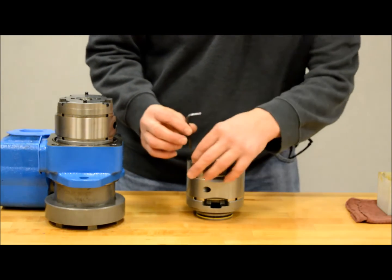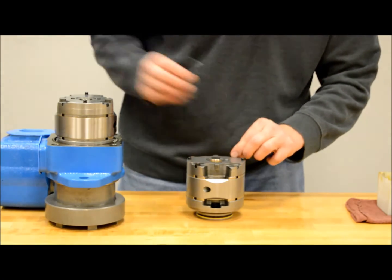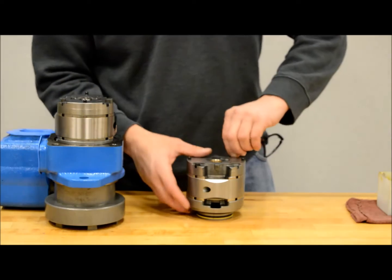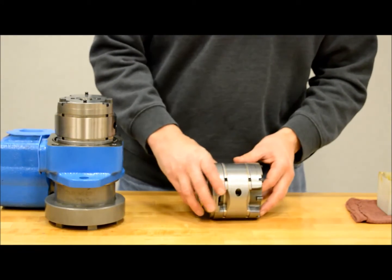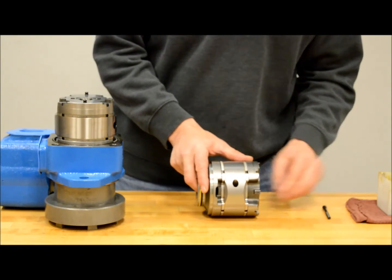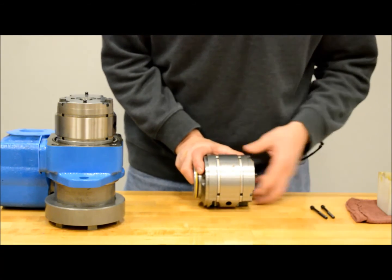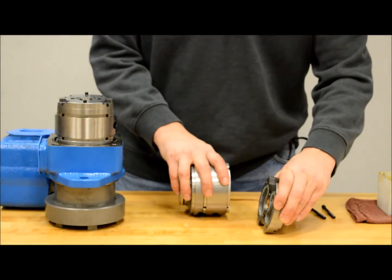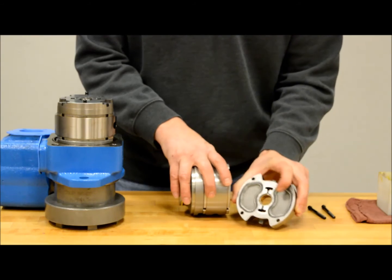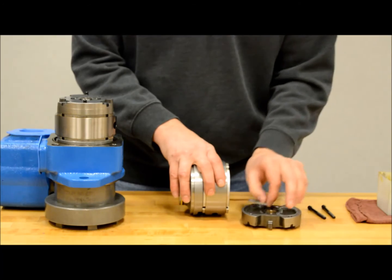You will want to loosen the two screws holding it together. Before removing the screws, completely lay the cartridge kit on its side and then remove the screws. Keeping the screws slightly in the kit will keep it from sliding apart, especially if it is full of oil. Remove the screws and slide off the top of the inlet plate, leaving the flex plate in place. Under the inlet plate, there are a set of seal packs. If they fall out, they can be easily reinstalled without damage.